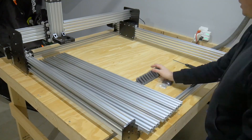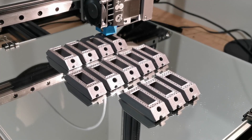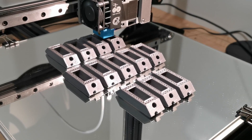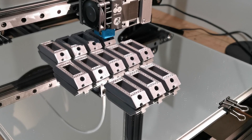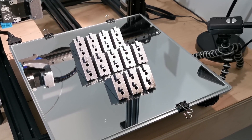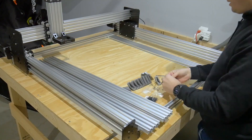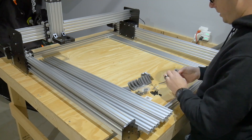As I have decided to lay my 20x80s flat on my table and then mount my spoiler board on top of them, I needed a way to mount these that is not included with the kit. I was able to print some relatively strong mounts — linked to the STL file below. This should give enough support once bolted in and the spoiler board screwed on top. Another route would be to order these when purchasing — I've placed a link to Bulkman 3D below to save on shipping.